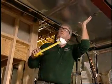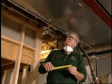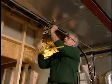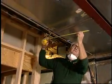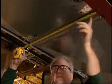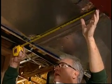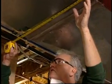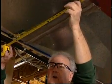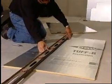Okay, now we're going to work with the bottom. We're going to insulate the bottom. And we're going to focus in. You'll notice I came down about 1/2 inch because that's the width of our material. We've now put in the little spacers all the way down the I-beam. So we have both sides insulated. And it looks like we're going to need a sheet about 24 inches wide, Cesar, to start going down the bottom of this trunk line here.